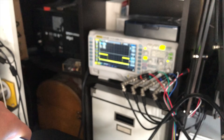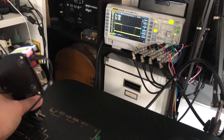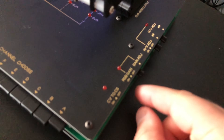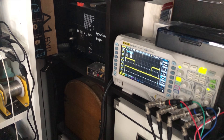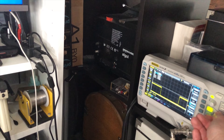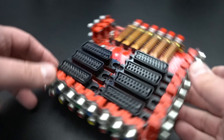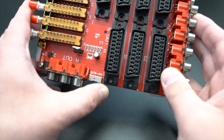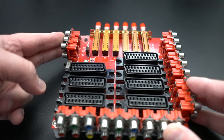Simultaneous output with the SCA101 is where it gets a bit weird. With the RGB gain turned off, the output is just passed to all options, and it's not good to use more than one output at a time — the voltage will drop and it'll put a strain on the console. If you turn on the RGB gain control, the signal is routed through an amp and should be safe to use multiple outputs, but unless you have an oscilloscope, it's impossible to know how high to set the gain. Definitely aim for dimmer rather than brighter, and I'd consider simultaneous output an expert-only feature. The Otaku switch has two outputs, but only one can be used at a time as there's no distribution amp.